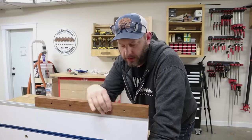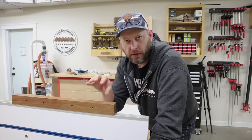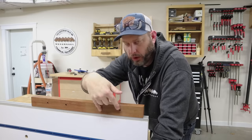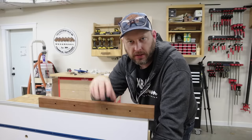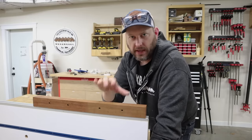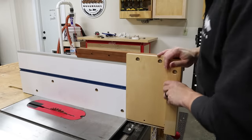What makes this whole thing work is this slider that I built to ride in the aluminum miter rail on top. I made it out of two pieces of three-quarter inch Peruvian walnut — you really just need any type of dense hardwood that will stand up to a beating. I put T-nuts in both sides and sandwiched it together so I have the ability to bolt on accessories on either side. It slides back and forth with a nice smooth ride with not a lot of slop, allowing me to attach any jig or fixture that needs to slide across the saw. I'll leave a link in the description for the miter rail system because it's the best one I found for this job.